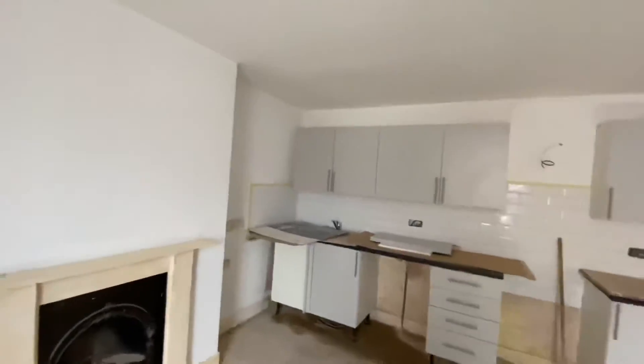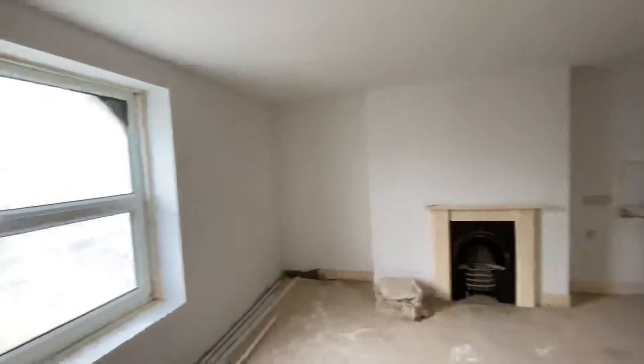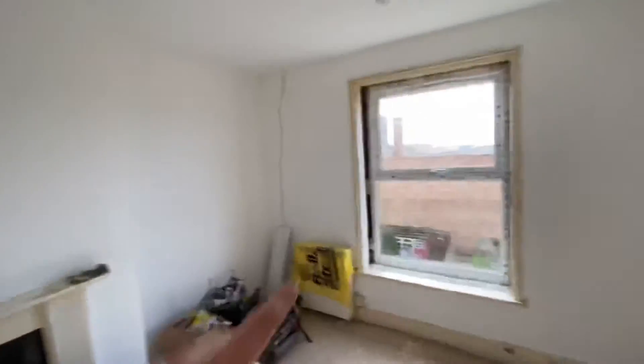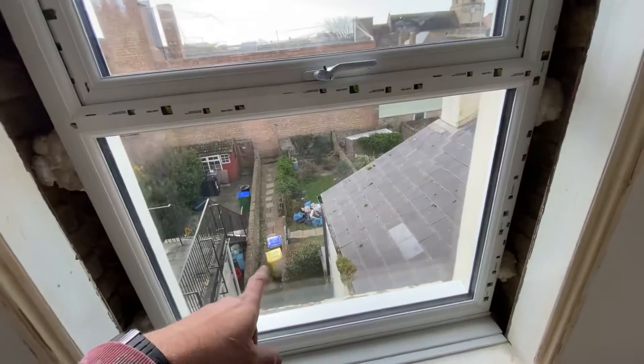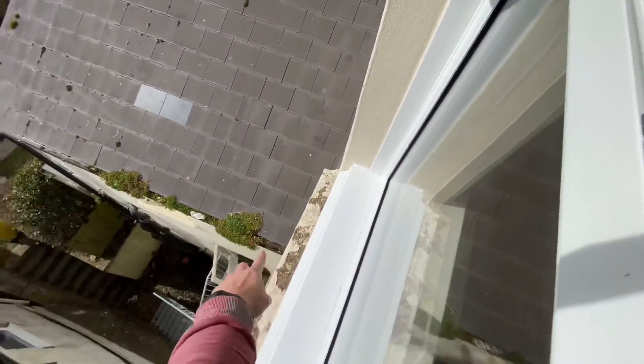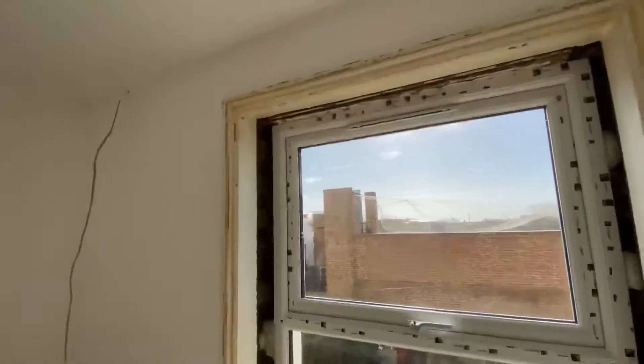It's the end of the third week now — I think it's like day 14, but it's been three weeks since we started, on and off. Everything's been whitewashed now, just one coat to see what needs filling. This is the ceiling I plastered in previous videos — a little bit there, a little gouge there that needs filling, but it's not too bad actually. The kitchen's in, all tiled. In this room, it's all been whitewashed and I've put a new window in. I set it forward because water was getting through — I've put a big seal on there and an extra bit of plastic to kick the water away. There's also a vent fitted.